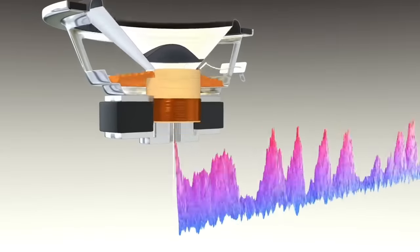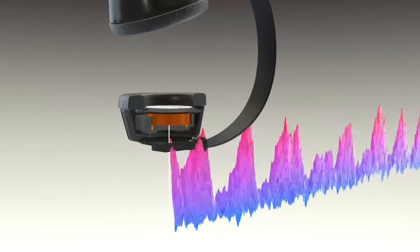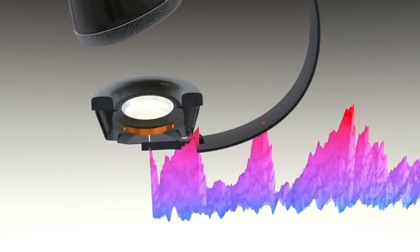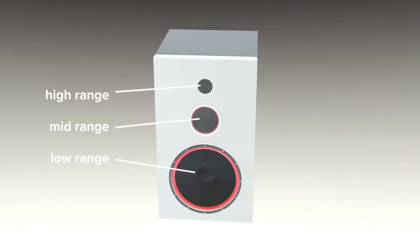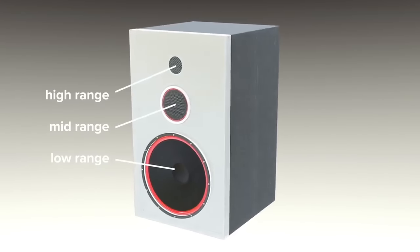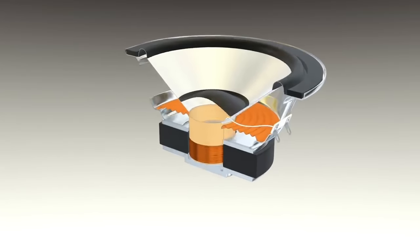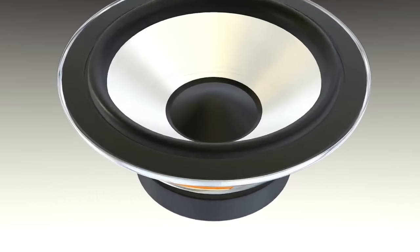Sometimes you can have one speaker faithfully represent the full sound spectrum — like headphones, for example. But in a room, bass gets much more difficult to reproduce to get the sound wave to reach from the woofer to your ear. This is where crossovers come into play, and how speakers can be designed to hand off the frequencies to better-suited drivers. This is where two-way and three-way systems enter — a woofer and a tweeter in a two-way design, or a woofer, mid-range, and tweeter in a three-way design, all working together to faithfully reproduce the original signal. And that's how a speaker works.